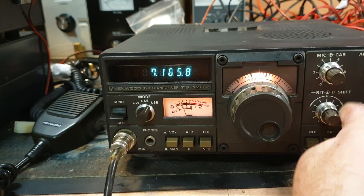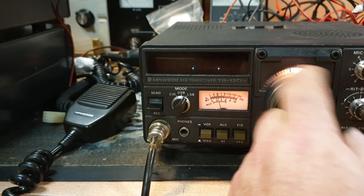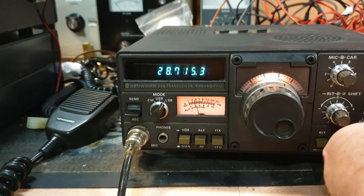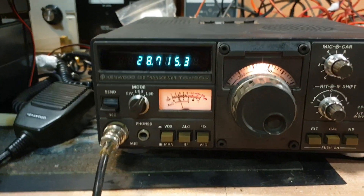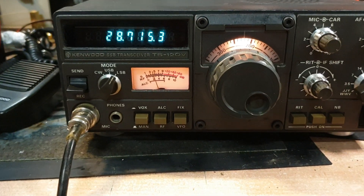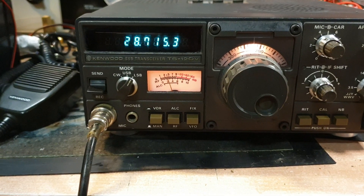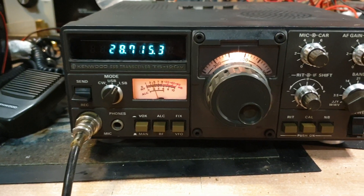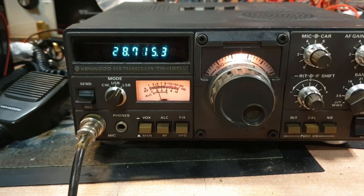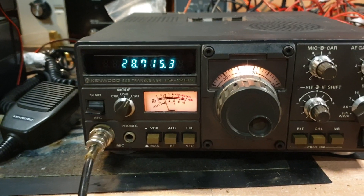It's not dropping any bands — I say that and let's just have a look... it's dropping 21 MHz. I know why. There's a little green wire modification on this — you'll find it's actually sitting on 28 MHz, sitting on 27 MHz. This was one of the little things that people did — often they just cut the wire.